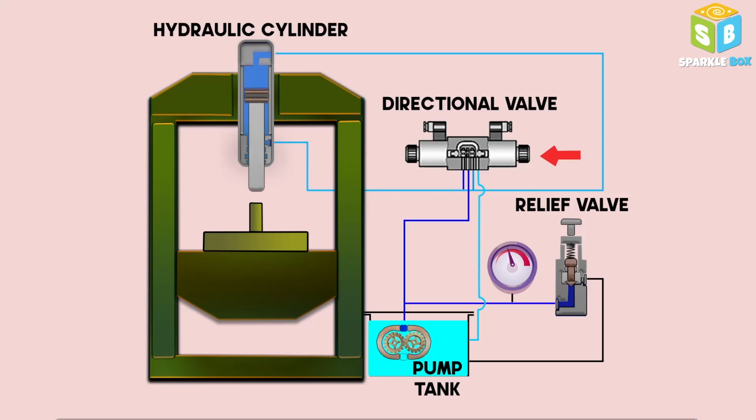The pressure therefore increases until it is in a position to overcome the resistance, until the piston in the cylinder moves, so that the hydraulic circuit is protected from excess pressures and hence from overloading. The maximum pressure must be limited. This is achieved using a pressure relief valve. The flow still delivered by the pump flows by a pressure relief valve directly back to the tank. The pressure at this moment is maximum.